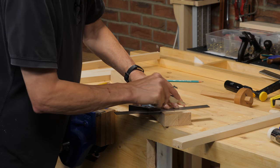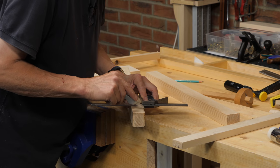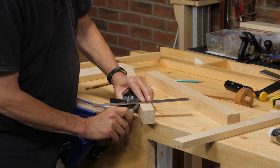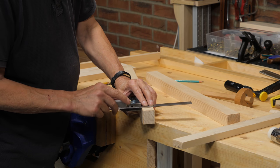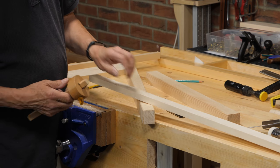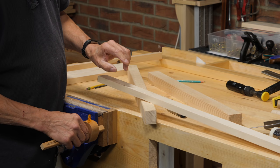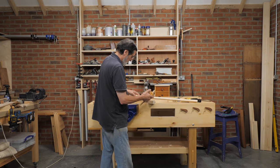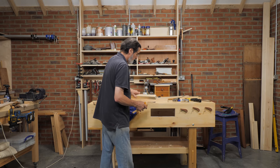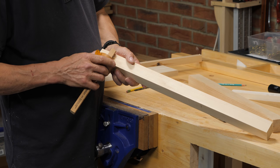We cut one notch, so what do we do now? We've got to get the depth, so bring your knife wall down onto this face here. None of this is going to be seen when it's finished. Bring your knife walls down onto those sides, both sides, and then run a gauge line between, and that gauge line, I know this is obvious, but the gauge line is the thickness of that piece of wood. Run the gauge line here. And here.